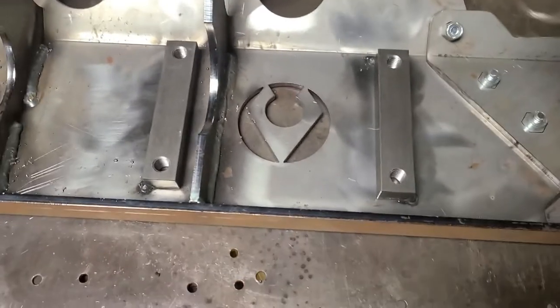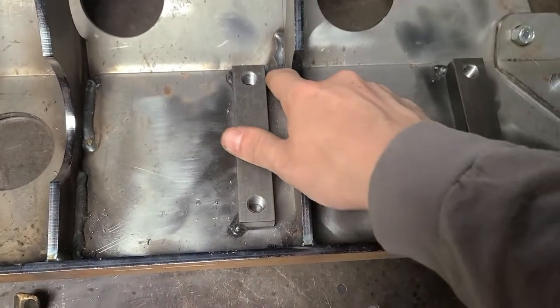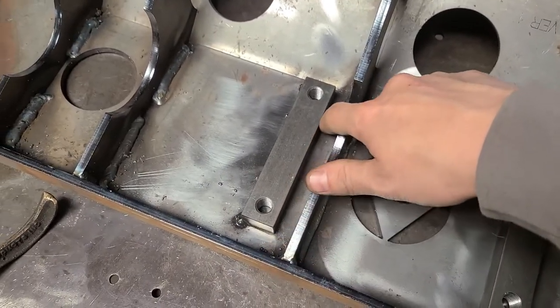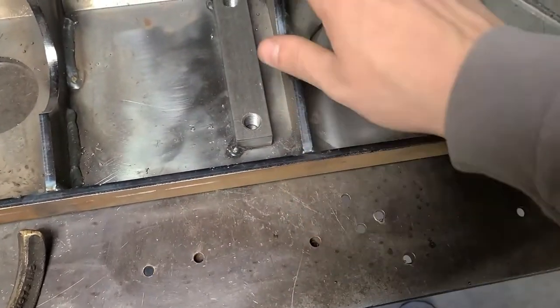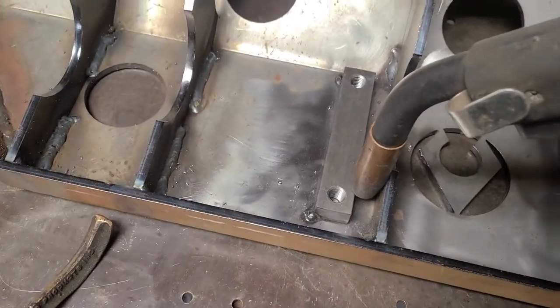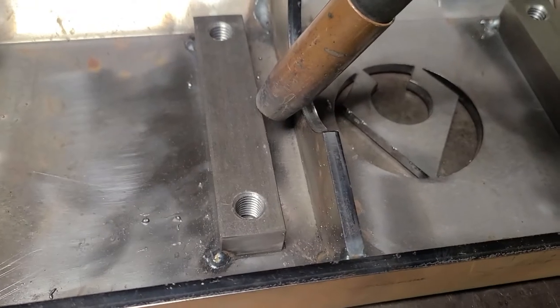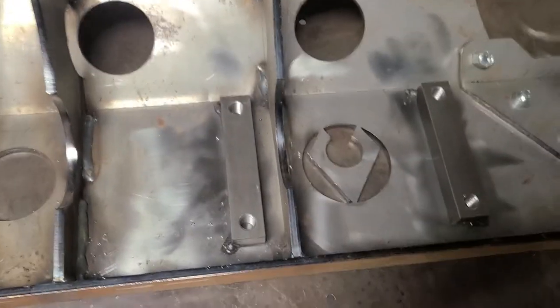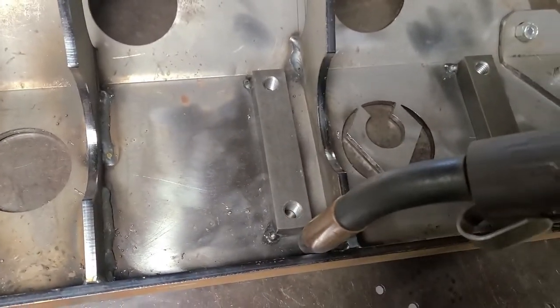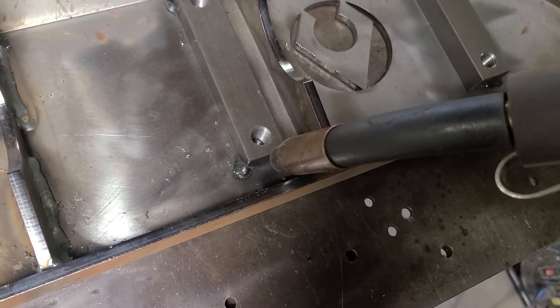Hindsight — putting this stuff together, you just don't know. I thought I would have enough room here to get the gun in there and get it welded in, but that's just not going to be the case. As tall as it is up here, I take my gun and I'm not going to have very much accuracy. This is a half-inch tall block, so I could probably get a little bit inside this C. I'm probably going to do an inch, maybe an inch and a half, trying to get down inside of there. Up here is just the same — I can fit the nozzle just barely but I'm not going to be able to get the angle I need. Those are going to suffer a little. Same on this side — on this side I'm good all the way around, but here... I'll tack, I'll weld what I can inside of this, and all the way around — three sides for sure.